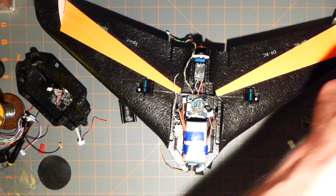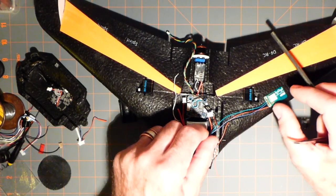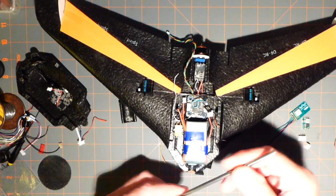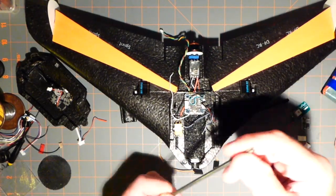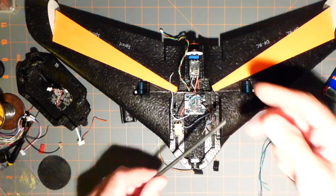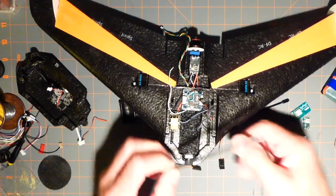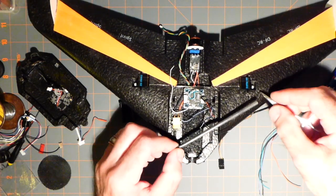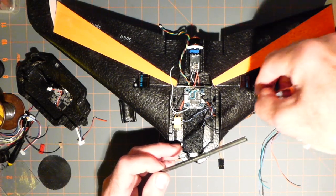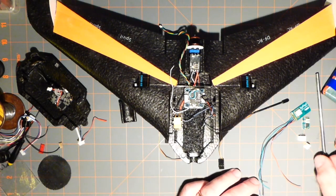Like I said, I have to cut holes in the wings because of the Pico. So this guy's probably going to go out here like this, I would figure. And the way I'm going to cut a hole is with this old epoxy brush handle. What you do is you take a carpet knife and you just go all the way around, and you cut ridges on it, and it makes kind of like a blade. Then I will go probably from here and dig here and go this way and probably come to there, I would say. Instead of having to dig a hole, I would just rather cut a slot from the Pico GPS to there, and then go down and do the hole, and then there into the flight controller. And I think that's pretty much it.